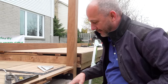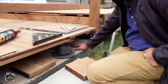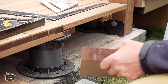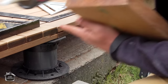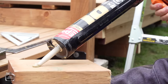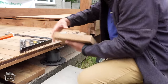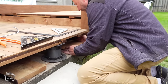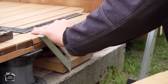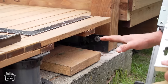So we're in a unique situation because these pillars are generally designed for rooftop assembly, but because of our patio and our needs to create the level, we now have to build a fascia system around this deck. So in all my years, the simplest way to solve a problem is using adhesives. And so what we're gonna do is take our scrap wood, a few good dollops of the good old glue here. We're gonna set it on the concrete relatively flush, use our little square to identify where that is, pull it up, there we go, and let that dry overnight.